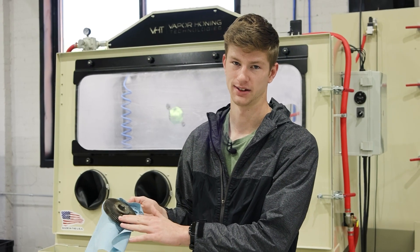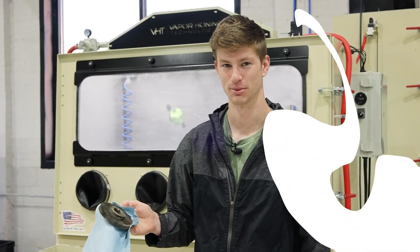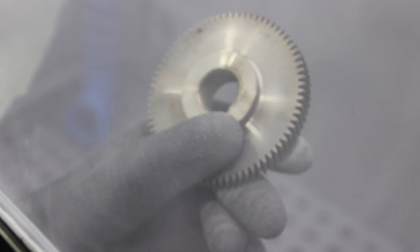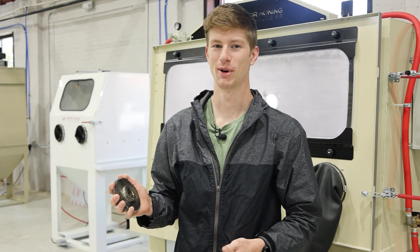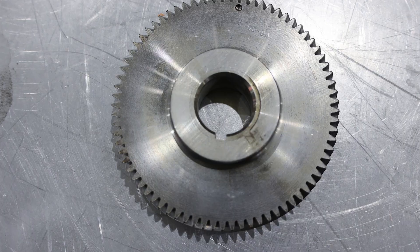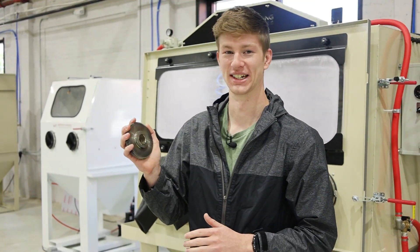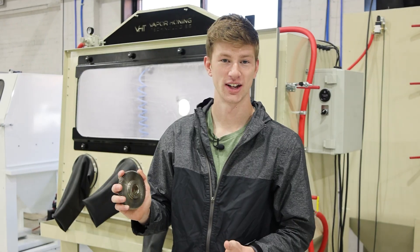To demonstrate, I'm going to take this gear — we've actually soda blasted the right-hand portion — but I'm going to show you some blasting footage with this left-hand side. You can see how quickly this soda blasting machine can remove all of the grime left on this part. This thing has been sitting in a junkyard and was actually made in the 90s, so that grease and grime was definitely on there, but soda blasting had no problem with it, especially in a dry soda environment.